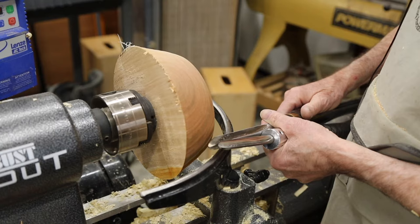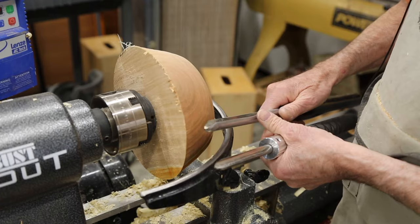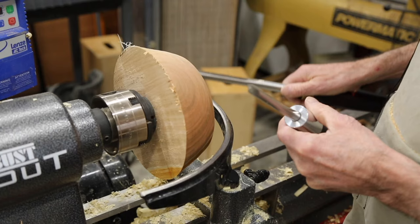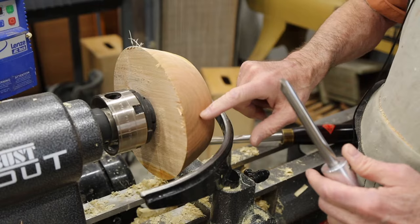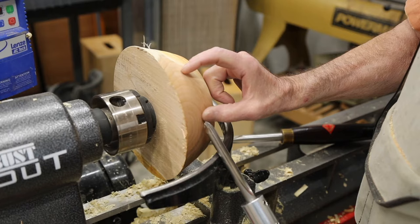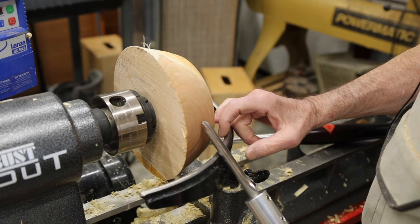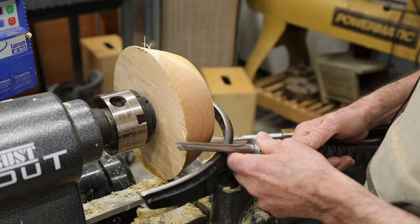This is a Henry Taylor Superflute Bowl Gouge, been around since 1976, and here you have a spindle gouge. We can't use a spindle gouge for faceplate work. In faceplate work the grain runs across the piece — that's the center of the tree, with the annular rings right here. If we were to cut with this gouge in the way we normally cut, it would catch in this area and rip the grain right out of the piece, and maybe rip the tool out of your hand, break the handle, or rip the piece off the faceplate — maybe all of the above. So you really can't use a spindle gouge this way; you have to go to a bowl gouge.